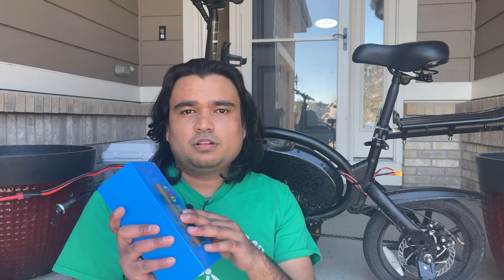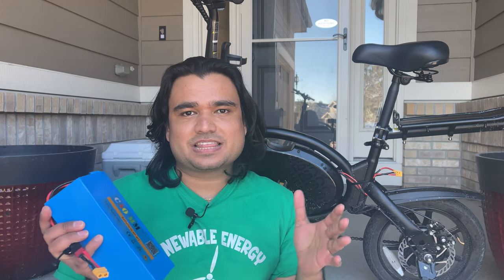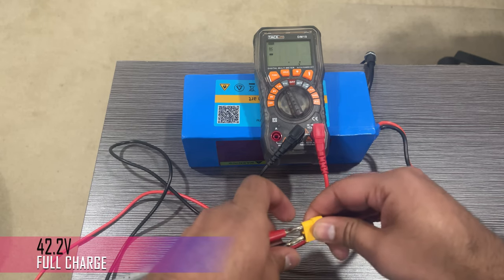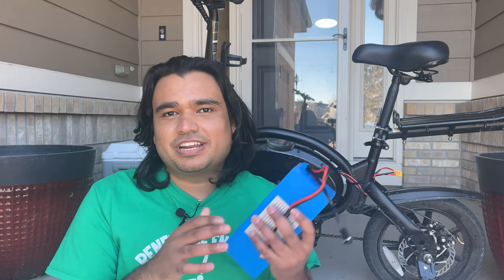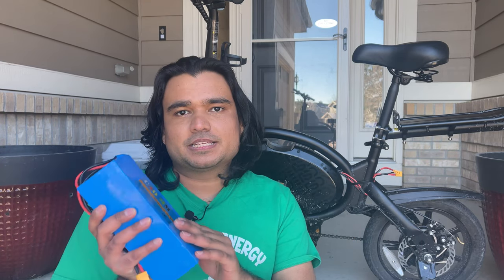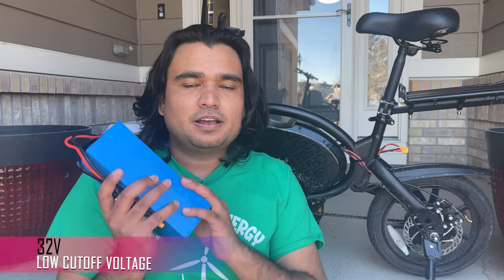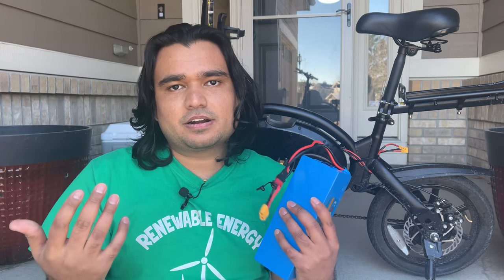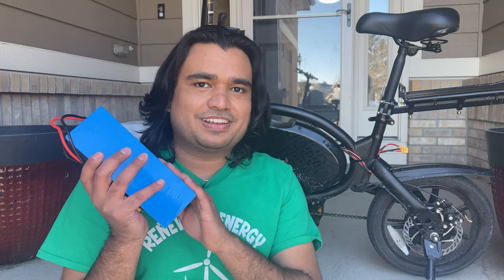The nominal volt, often referred to as average volt, for this battery is 36 volt. Even though it's a 36 volt battery, to maintain that 36 volt throughout your riding experience it needs to be higher in the beginning. So at full charge, this battery reads about 42 volts. Even if I plugged it in longer than when it said the battery was full, a couple hours later I was still reading 42 volts — which means the over-voltage protection system is working. The battery completely turned off at around 32 volt, meaning the automatic low-voltage protection system is also working, because dropping below 32 volt could cause permanent damage to the battery.